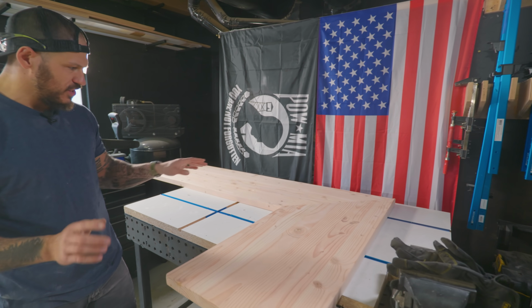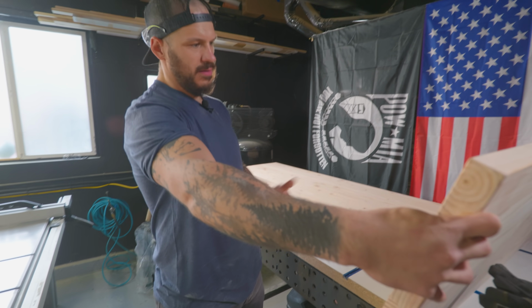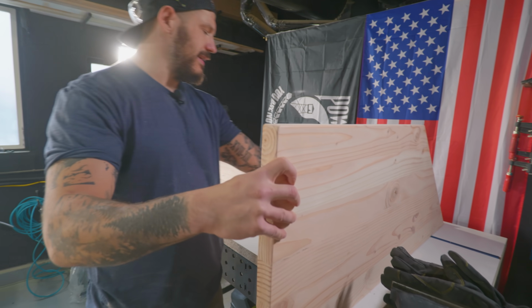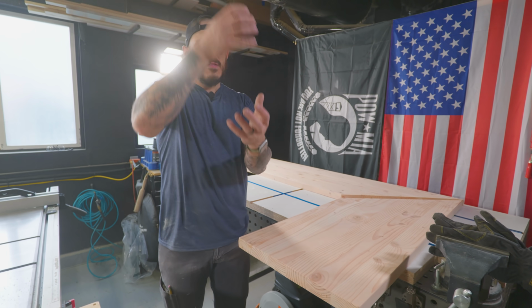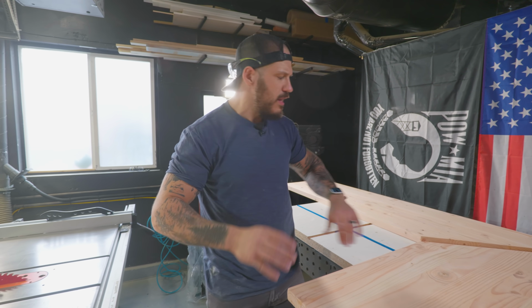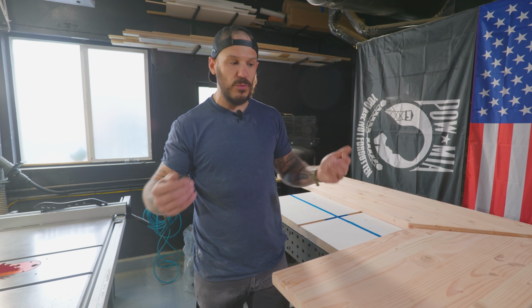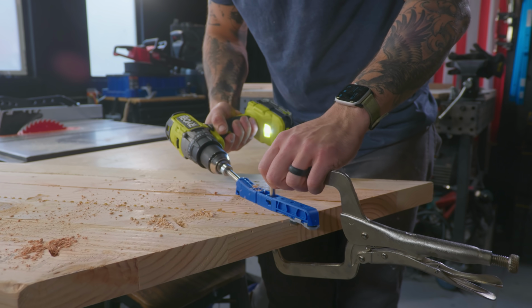She's all lined up now, securing this joint here. We're gonna flip the sucker over on the ugly side, or the hideous side, if we even call that. Well, we're gonna put pocket holes inside here. We're gonna use some wood glue. Now, wood glue tends to soak up, kind of like flowers in a vase. They'll soak up the first initial wood glue before the pores are closed. So what I'm gonna do is put a small layer of wood glue, clog those pores, and then put the final layer of wood glue, and then pocket hole the sucker in place, and let her dry.